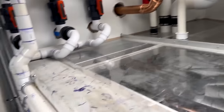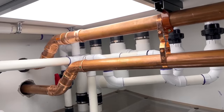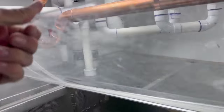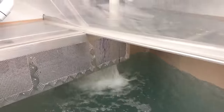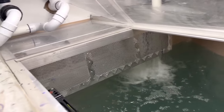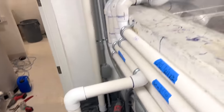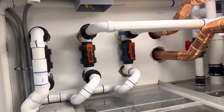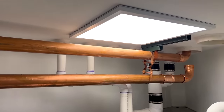This is awesome — turning up several of my pumps to see how much water I get flowing through here. They're all coming down big giant pipes there from the skimmer drain, coming through my basket. You've got to see the water flow into my vault, then the basket catches debris, it goes out through the bottom of the vault into the pumps, then out through the filters and heaters in the other room, through the outlet and return lights, and then back up into the pool.